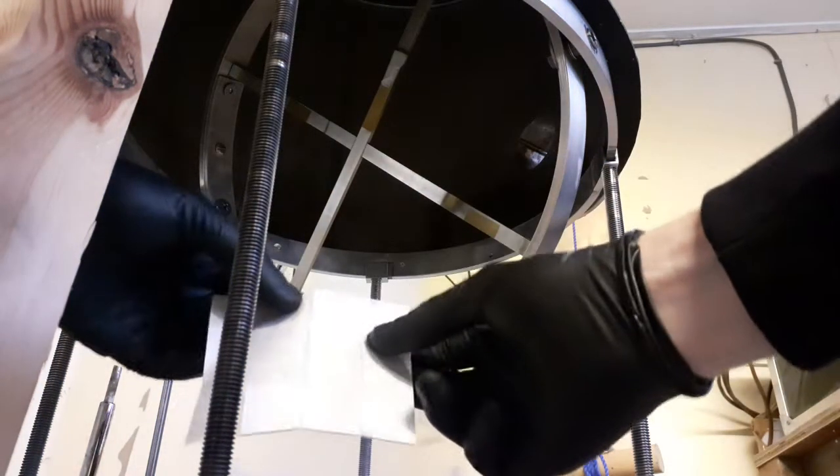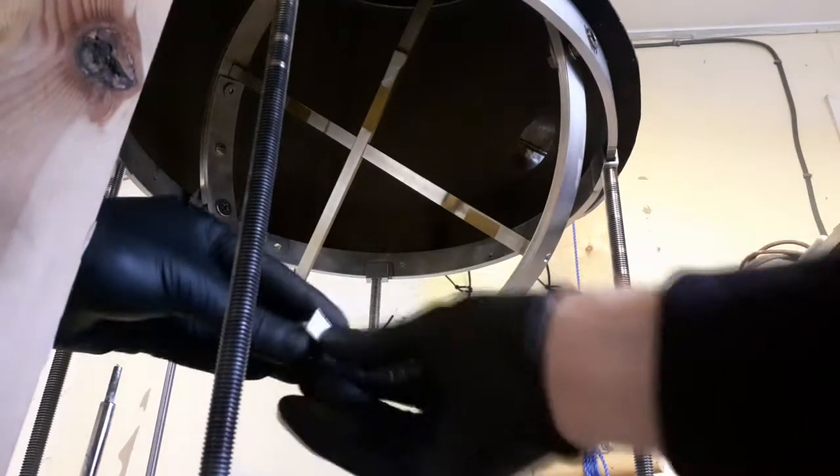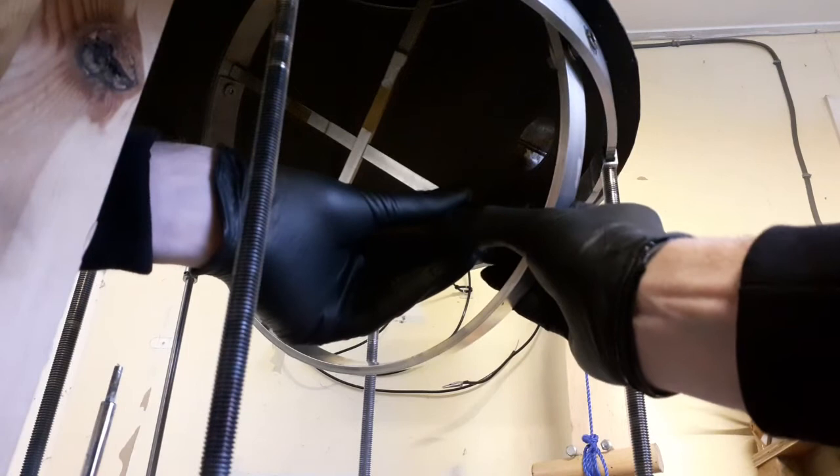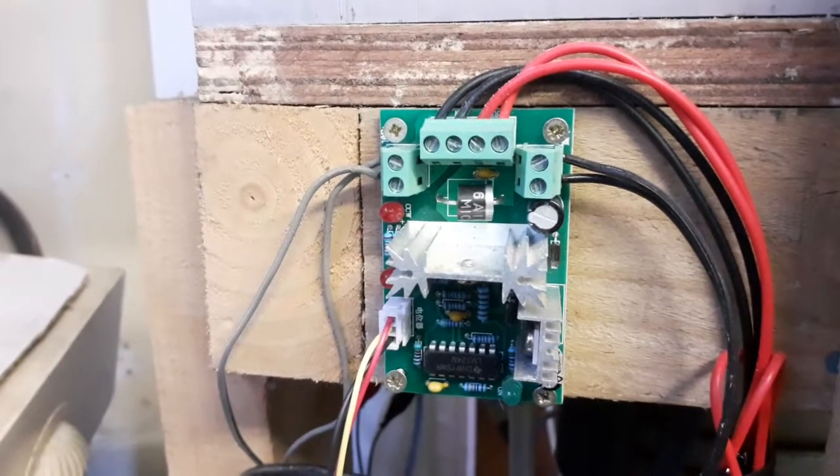To load, I use sticky fixers and gloves of course, because you don't want to have any fingerprints on your pieces. They're pretty reliable. What I didn't talk about in the last video was what motor turns the rotisserie via that rod. So it goes through the rotary feed-through and to that motor there, with a little flexible coupler to make sure not to put any axial load on the rotisserie, because that might break the seal.